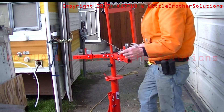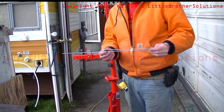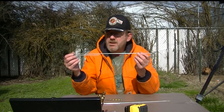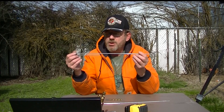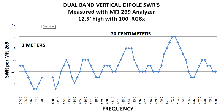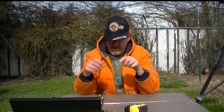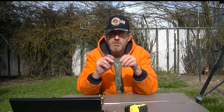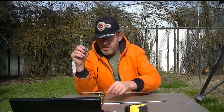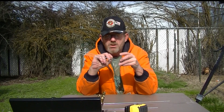And there's the second one — a little easier the second time. So now I'll cut these off to length and they're ready to install. The next thing I'm going to show you is how to cut the elements. This is one of the elements from the antenna that's been tested and works pretty much flat across both bands — two meters, seventy centimeter. I'm going to reproduce this exact cut. This is a seventeen sixty-fourths drill bit — it goes through and just barely touches both sides. So I'm going to modify the two that I've made with the vise grips and this drill bit until I get this distance to equal what's here on this drill bit.